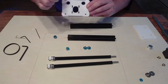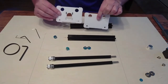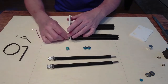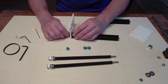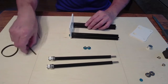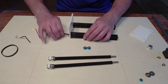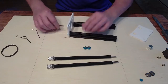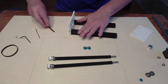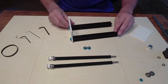The bottom has the bigger holes on top and the smaller ones on the bottom, with the center hole in the middle — this is going to be the back plate. The big holes go on top. Put the screws in and get them started by hand. Make sure they're flat to the table before final tightening. Do not over-tighten because this is acrylic and it will snap very easily.